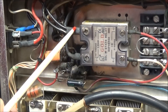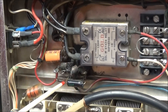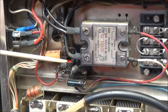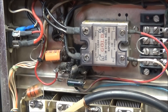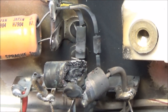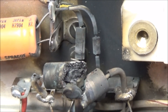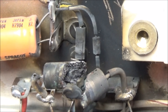I'm going to remove these wires off of this end of the relay to get them out of the way so we can clean this up and check these components to see which ones are faulty. We'll probably just go ahead and replace just about everything down here since it's all smudged up. You can see the components behind this wire are pretty charred. Now with those two wires out of the way, you can see a better idea of just how charred everything is down there — it's been flashed over from that resistor going nuclear.